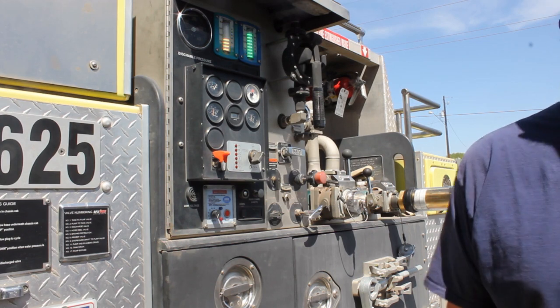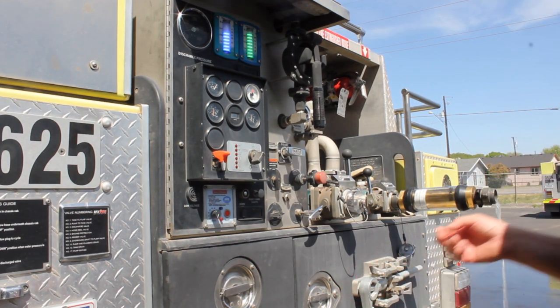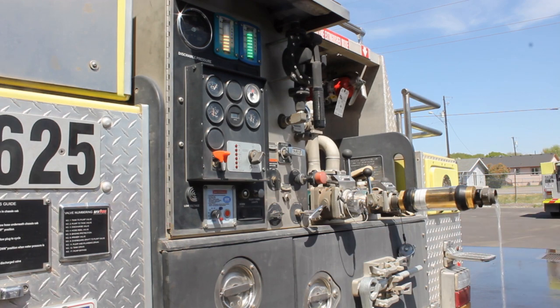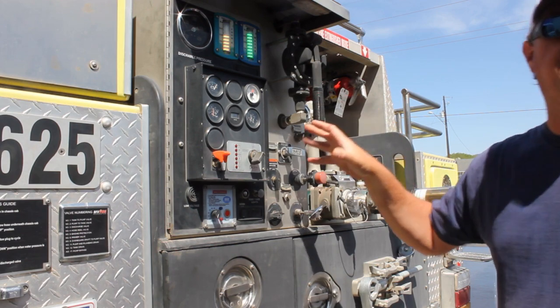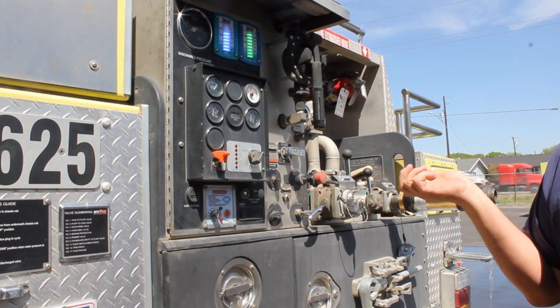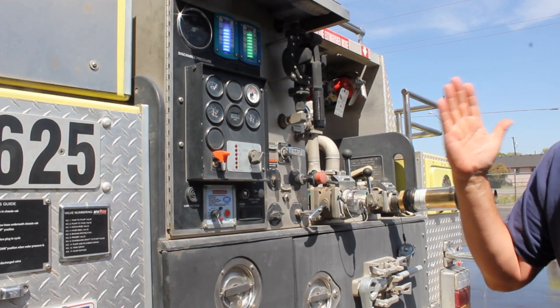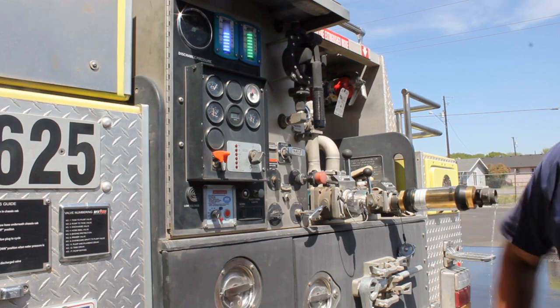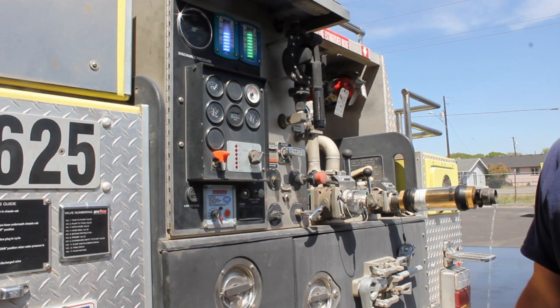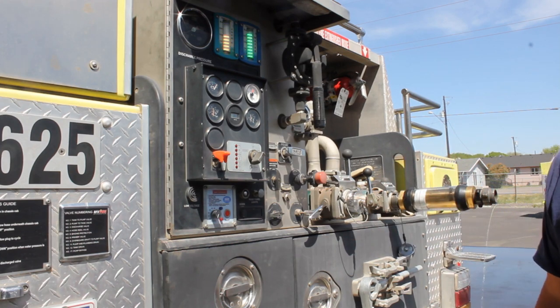Okay, so now we just did 300 and we were 42. Right? And it's funky. You gotta back it off a little bit and adjust this guy. This pump is at high crank RPM. It's pretty close to its flow. There are a couple of them out here where it's actually backed off quite a bit to get the flow up, so be aware of that. This one's much closer to that crank-all-up type of thing than some of them are.